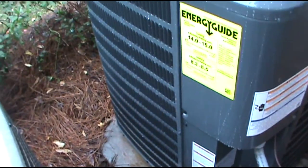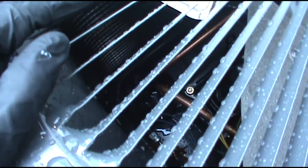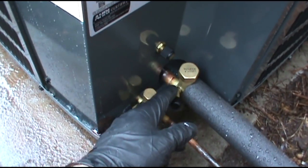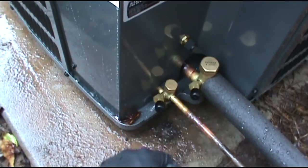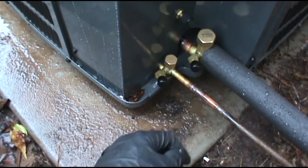Yeah, and again, I apologize for not filming it, dudes. I just wanted to concentrate and remember all the steps, you know, to remove the valve cores and wrap the service valves with wet rags and all that stuff. I didn't want to cook the valves. Just remembering all the little things. It's just been a while, man.